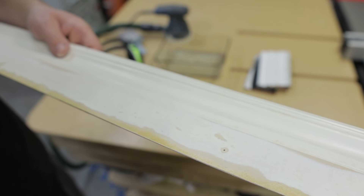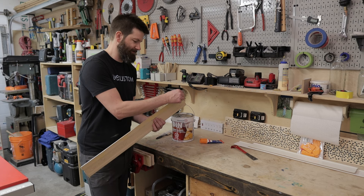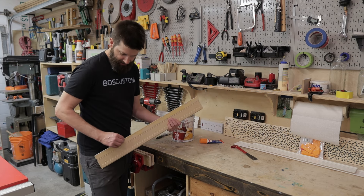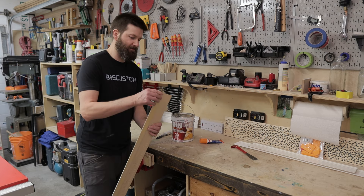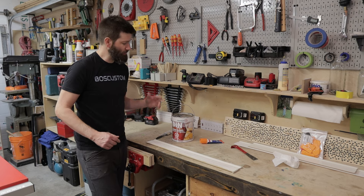Now that we've got that all nice and sanded flat, you can still see it's a little bit rough along the area that was sanded. Before we hit this with some primer, you also want to make sure you get any of the loose bits off — you can pretty much just use your fingernail to take the loose bits of caulking off, then give it a little wipe.